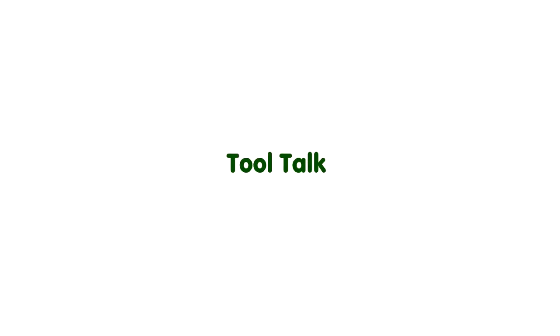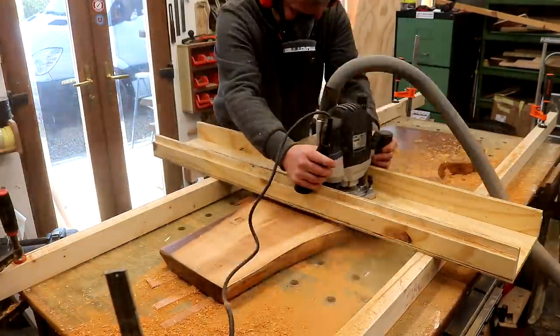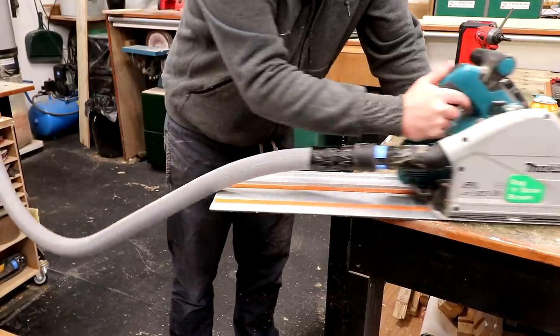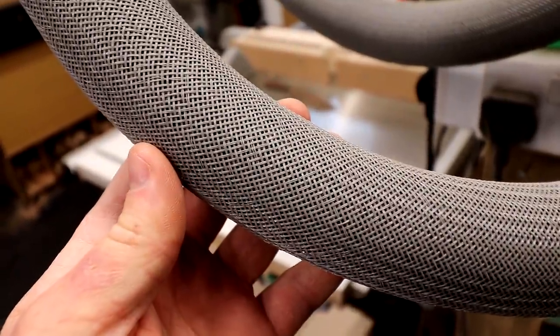Tool talk - I've got a few new bits. Obviously the Trend T7 router which I showed in my slab flattening video, which I was reasonably happy with aside from the poor dust extraction and the amount of time it takes to stop spinning when you turn it off. It's certainly got plenty of power. Then there's all of the new router table stuff which I'll cover in a future video. I also got a braided plastic sleeve for my dust hose from eBay - really pleased with this as the vacuum hose no longer snags on tracks or rails, and it was definitely worth the £8 I spent. The size I bought is 28-47mm and it fits a regular vacuum hose perfectly. It has quite a lot of stretch across its width, but the more you stretch it the longer length you'll need, so bear that in mind.